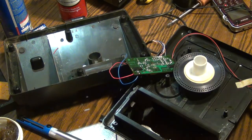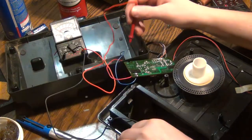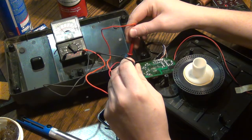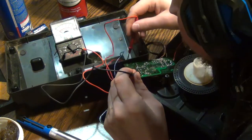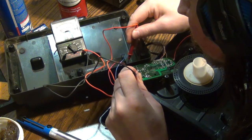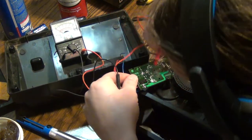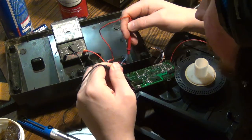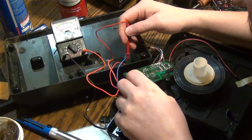I don't think they're mixed — we can check the continuity. I'm going to go red to red, and you can see it's obviously making a good connection. Everything's fine. But if I touch blue — it's acting like it's making a connection. Red to red yes, red to blue should be no. But when I'm touching blue, it's like it's trying to establish a connection.